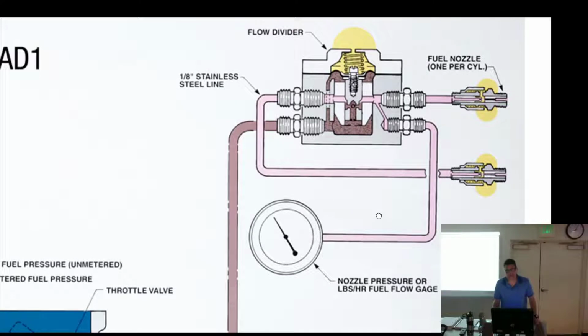So if I say that the flow went up, as a mechanic, you've got to hear me say pressure went up. Right. All right. So it goes through the nozzles. Now the nozzles, I'll show you a little video on these. They're very sensitive little items. Don't hurt their feelings. There are different types. There's one type that comes in two pieces, but they're like penguins. They're married. You can never swap them out.